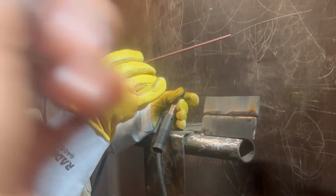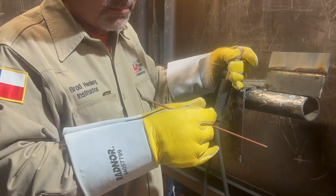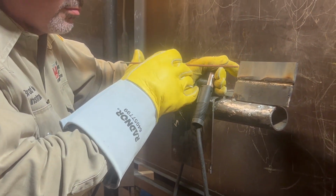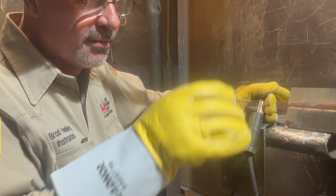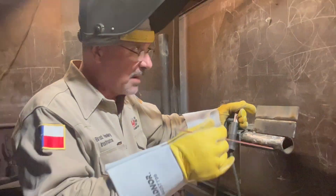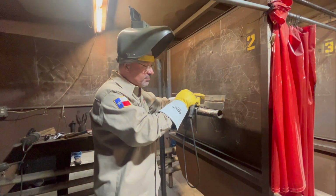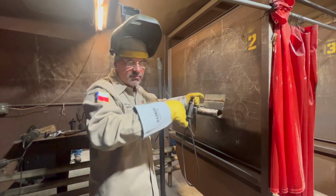So do you stitch that too? Stitch it, like, when you're going over? Yeah, similar to that. Some people call it whipping it nowadays. They'll call it stepping, you know. I'm going to cut that through there, and I whip it sideways, kind of like y'all did on the filler weld. Same thing. I'm going to make sure to catch both plates. Don't let it all favor the bottom.